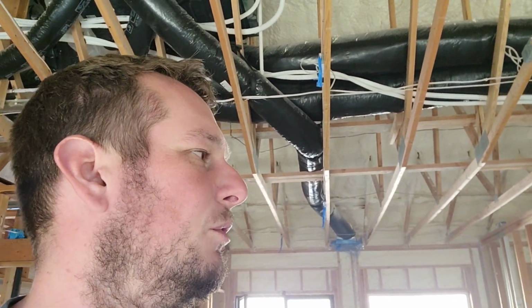Okay, so we're all finished. We're all wrapped up. When they finished the air seal with the AeroBarrier, and everything was taped still, my ACH50 or total CFM loss, I showed it to you guys, is crazy low. 100 CFM, just under. Okay, what was it, Paul? Like 0.2 on the ACH50, 0.23 on the ACH50.